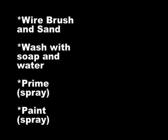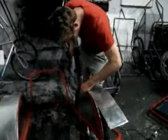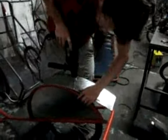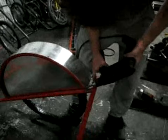Once the paint is dry, you may proceed with the application of the sheet metal for the fenders. There are two sheet metal parts for the ambulance: the mud guards, which go over the top of the wheels, and the wheel guards, which go on the sides of the wheels. The bottom end of the wheel guards is folded up once. The outside edge of the mud guards is folded under twice, and the inside edge is folded under once. Cut a slot in the wheel guard for the mud guards, and cut another slot for the dropouts. Secure all sheet metal to the ambulance frame with self-drilling, self-tapping sheet metal screws — 10 screws on each of the wheel guards and 5 screws on each of the mud guards.